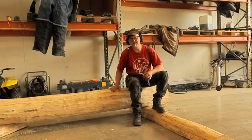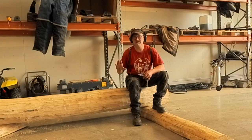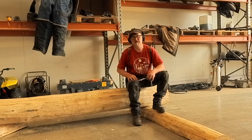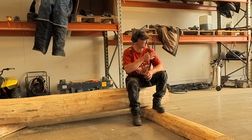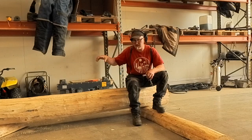So these are going to sit on top of the stones, and it's 30 centimeters thick. I'm going to drop it by 20 centimeters, which means a good slice is going to come off the bottom, and we have a nice wide base sitting on top of those stones. It's going to leave 10 centimeters sitting up above the half logs, which is a nice size because most of the other logs are a little over 20 centimeters. So when I sink those down, then they will be back to about half the log coming off.